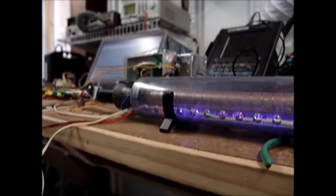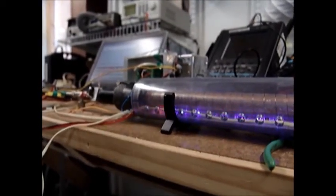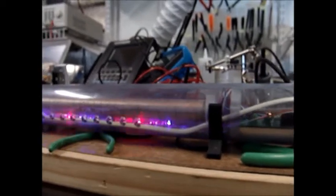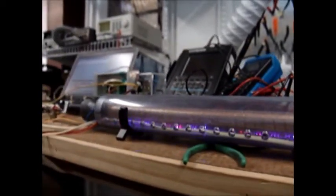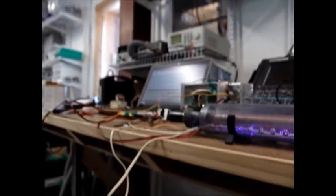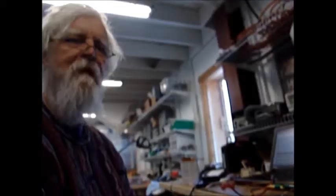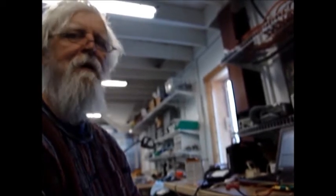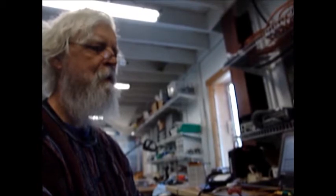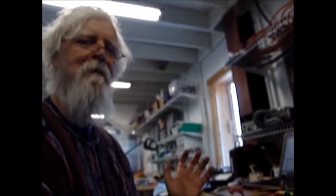What are these little holes for? These holes are the vent holes. When the fan turns on, cool air from the room flows in through the vent holes and cools off that tube in case there's any excess heat that needs to be carried away. That's all under PID control, so that tube stays at a very constant temperature. It's not perfect — there are lots of ifs, ands, and buts — but it's way better than anything else we've had so far, and it should be mostly immune to changes in ambient temperature.